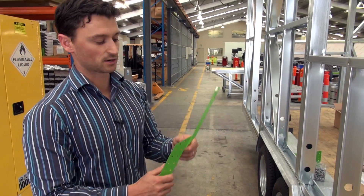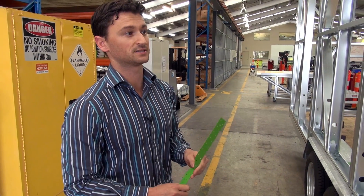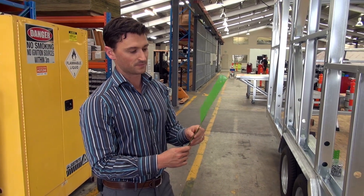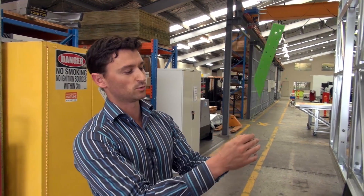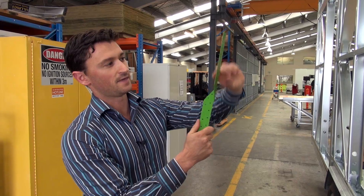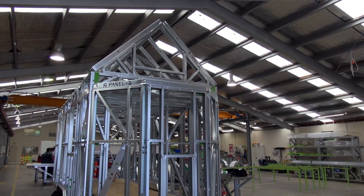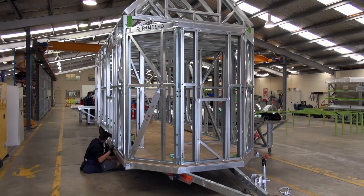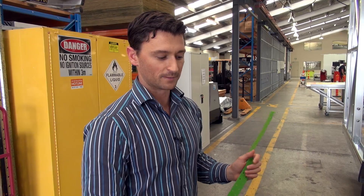The reason they call these cyclone straps is they're used in general buildings, not necessarily in cyclonic conditions, but also in areas where there are cyclone conditions. They connect trusses to the top plate — you'd have this running down the stud, wrapping either connecting to the side of the truss or even wrapping over the top of the truss, which prevents uplift. Because this is a new concept and it's not a stationary house, we are allowing for movement, braking, stopping, and different wind zones.